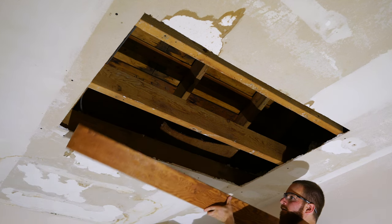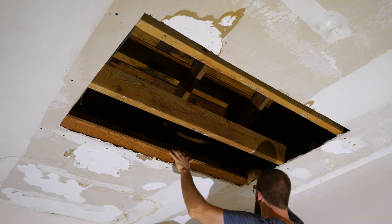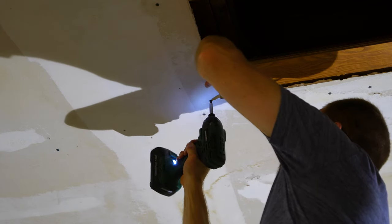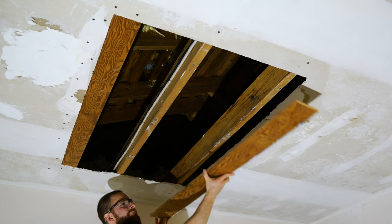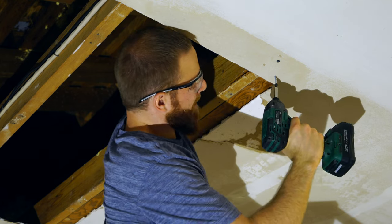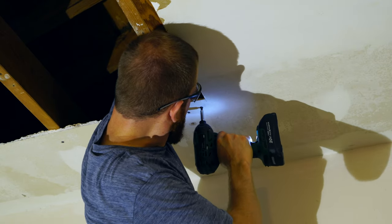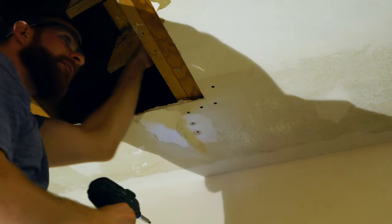I had to raise up the sagging drywall by using drywall screws. These boards aren't quite as narrow as furring strips, but I needed larger material for such a large patch. Mount the furring strips on top of the drywall, making them a couple inches past the drywall edge so you can mount with drywall screws — the boards I used are half-inch thickness. When screwing in drywall screws, check placement with your thumb to ensure there's enough gap for drywall mud. Note that furring strips only need to be placed parallel to the ceiling joist — the ceiling joists themselves are already present on the perpendicular sides. When mounting, hold down the furring strip on top of the drywall so the screw doesn't push it up and prevent a secure attachment.